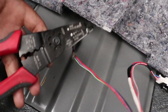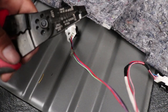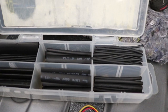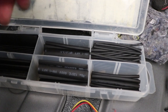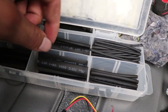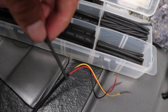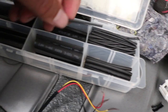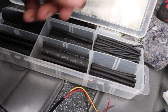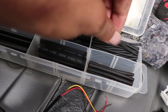To strip them back, you're going to want some wire strippers. You also have a cutter in the middle to cut any excess off. For the heat shrink, as you can see they're kind of long, so I usually like to cut them in half. You put them on the wire before you solder anything together — because once you solder them together you can't put the heat shrink over the wire, and then you'd have to cut it, put the heat shrink back on, re-solder it, and then apply the heat shrink.